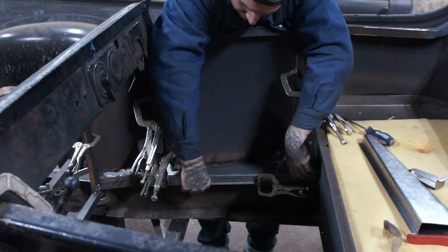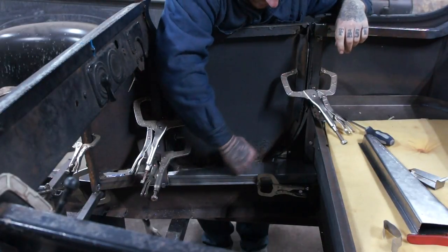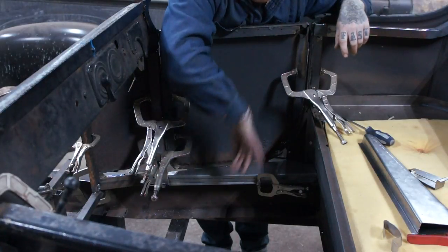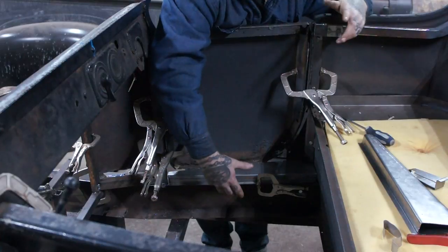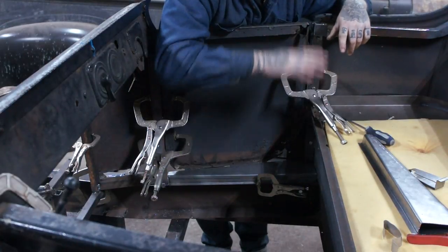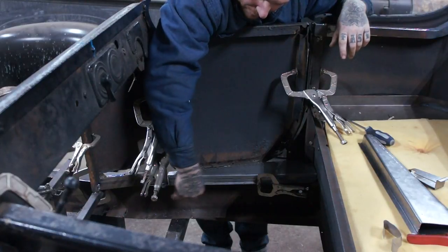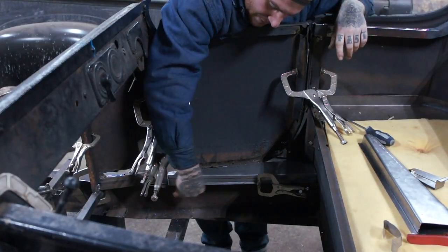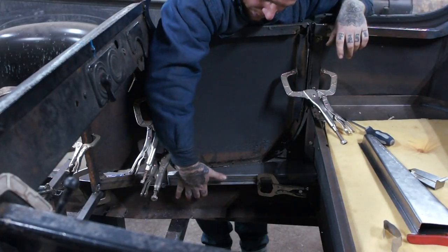It's pretty good. So this is pretty darn close to the edge of the door here, which is how we want it for this mock door sill we're making. The piece folds underneath, so it kind of disappears back into itself. So when you open the door, it doesn't look like it's just a sharp edge. It actually has a nice folded edge that goes inside. It's pretty flush with the edge of the frame here. Like I said, I'll just do a tiny bit of sanding to get it to sit how I want once we're into fitting the doors a little nicer.